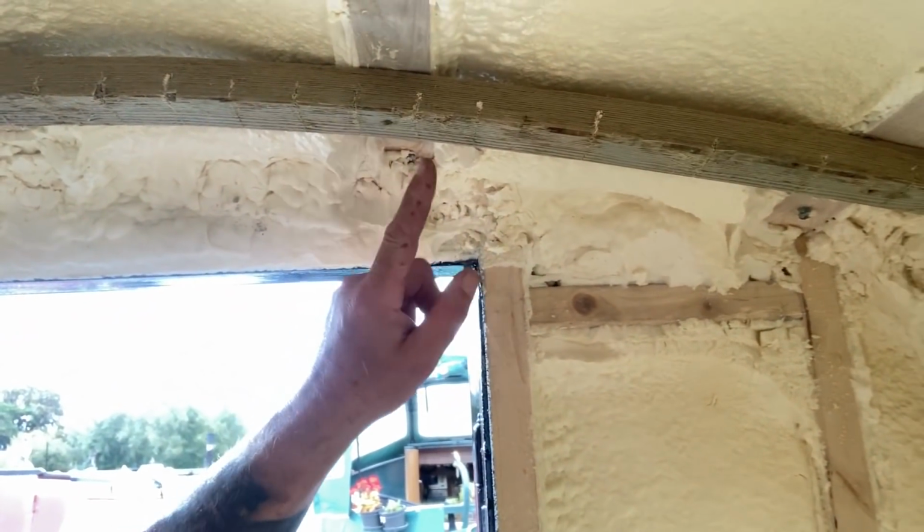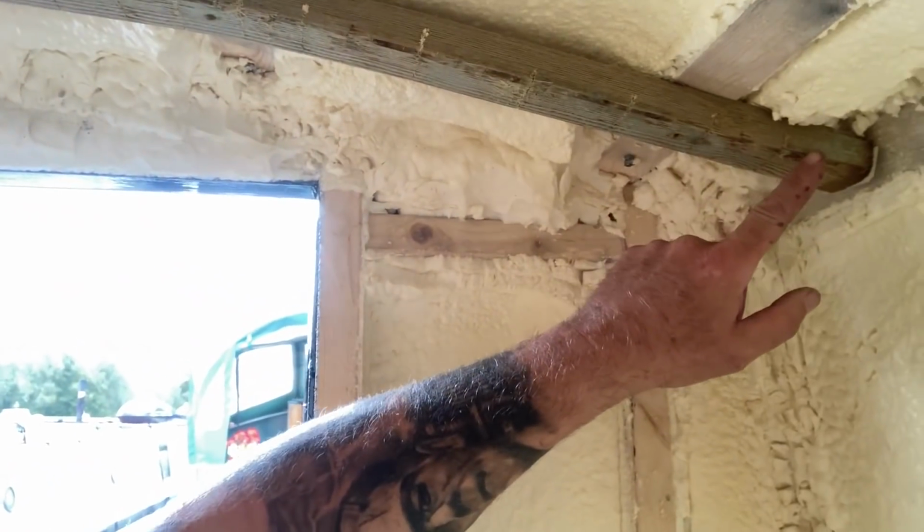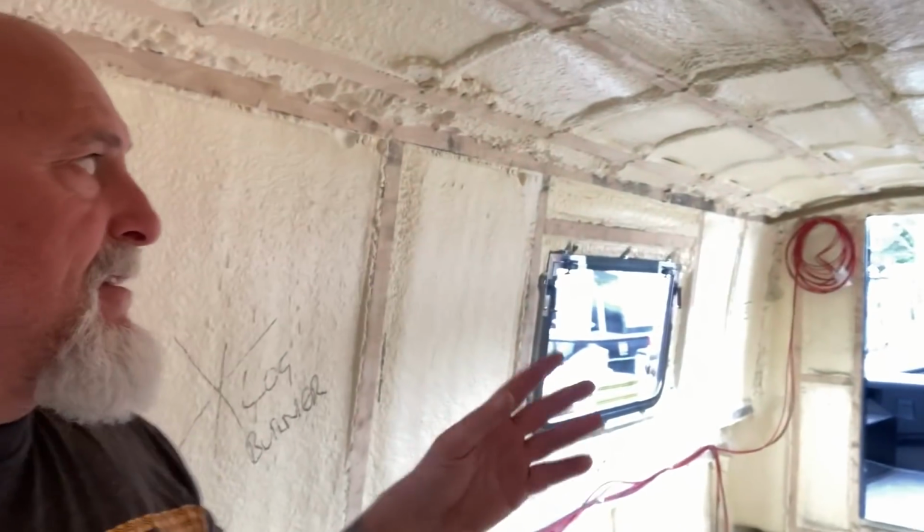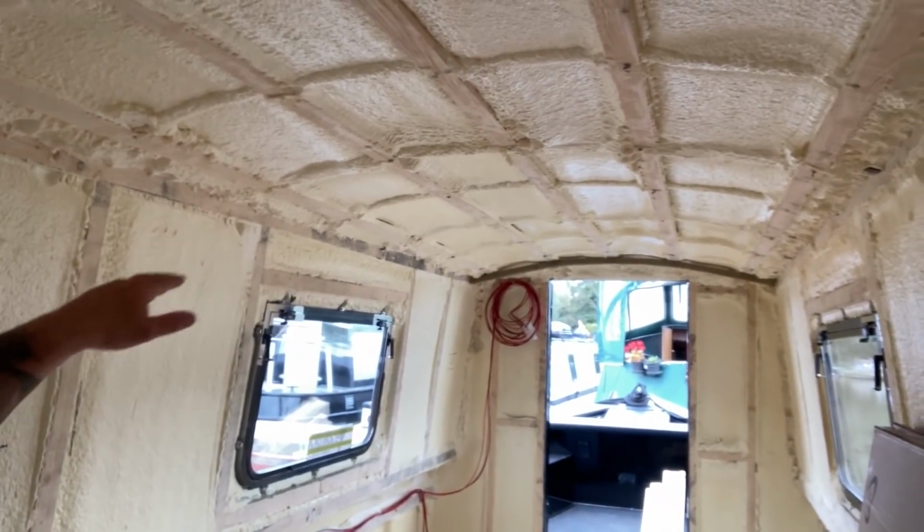No carpenters to talk to at the moment, although I do know a few. So what I've just done, and I don't know whether it's good practice or not, is I did saw cuts halfway through, all the way along, about every inch or so. I've not really measured it, it doesn't matter too much. That seems to have given it that little bit of space. So imagine them half mil cuts on the inside. It seems to have given me a fairly constant curve.